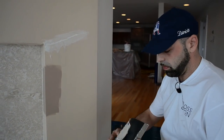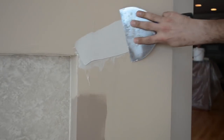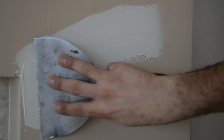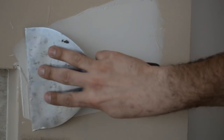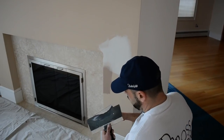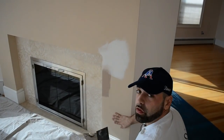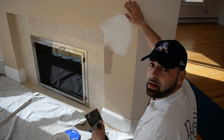You're going to add a little bit of joint compound on your blade, give it a little back and forth to work it in, and apply. It's going to shrink, so don't try to go overboard and put a heavy coat on because you'll end up with a lot of air pockets. Chances are this will have to be done at least twice. You're going to want to go around very far out — say if it's an inch and a half that you're fixing, you want to bring it out about a foot. We call that bridging. That way you get a smooth transition from the original wall to the patched wall and back, so you don't see a bump when the light hits at a certain angle.